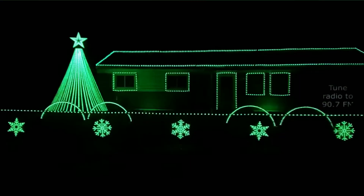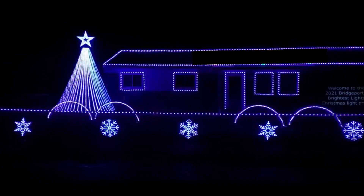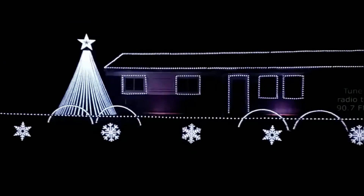First off, RGB pixels are the newest type of Christmas lights available today, and they can do a lot of cool stuff. Each individual light can change any color, anytime, up to 40 times a second, or every 25 milliseconds. The way each light does that is each pixel has a red light, a green light, and a blue light inside of it. You can turn on these different colors at different intensities to make different colors other than red, green, and blue — such as purple with just the red and blue on, or white with all three of them on.